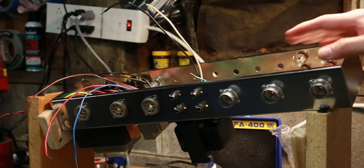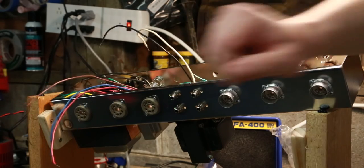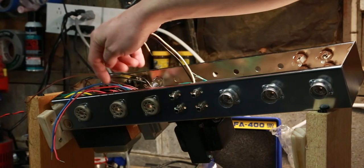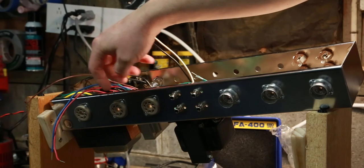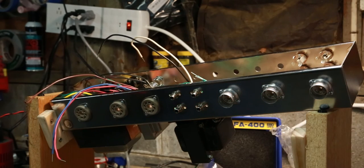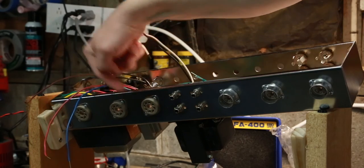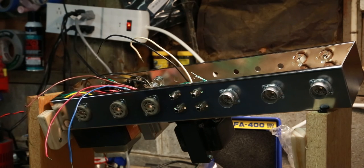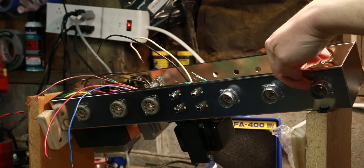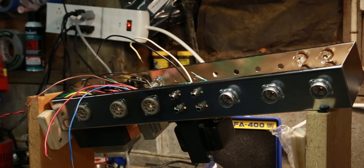This is really just the start — maybe an hour and a half to two hours of work, the kind of thing most people who like tinkering can do by just putting screws and nuts in. One thing to be careful of: I've aligned all the tube sockets the same way so the notch is oriented consistently. There's a key on the tube socket and on the tube so you can't get them misaligned. You don't want one pointing one way and another pointing a different way, because then it becomes really tricky figuring out which way the tube goes. Always make sure the notch is oriented the same way on all sockets.